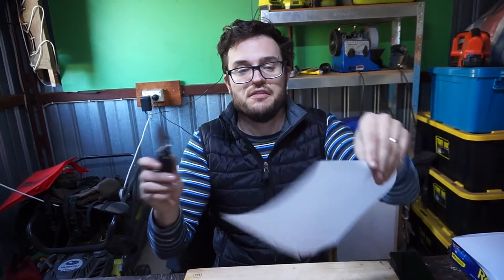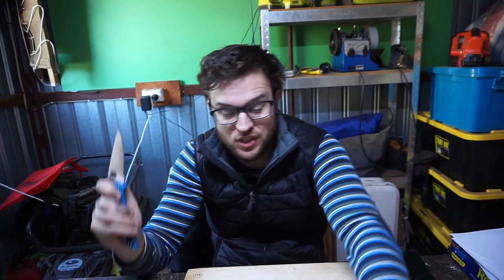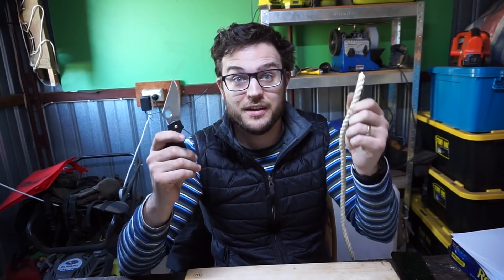I'm going to take it to my shop now and put a 17-degree mirror-polished edge on it. That's come up nice and sharp — a very slick mirror polish. We'll see how much rope this new edge cuts, keeping in mind it's the same as 17 degrees on the Endura VG-10 and 17 degrees on the Amalgam S30V. I did remove a little bit more steel than usual because the factory edge had some brownish schmutz on it, which looked like belt residue or possible heat damage, so I just took a little more off. It was actually really easy and nice steel to sharpen — I just sank more time into it than I supposed.